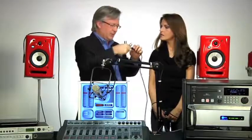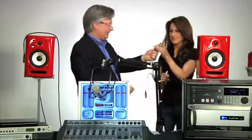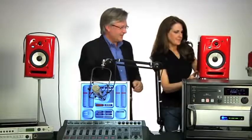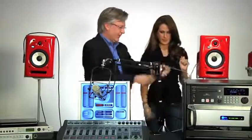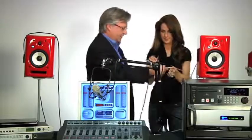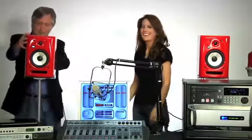Our speakers don't have an RJ connector like this, so we have another adapter from Radio Systems. We'll plug that right in — this is the right-hand speaker, so red right, there we go. Plug that into the back of the speaker. And now the left channel coming out is on this side. Let's just run a cable from this adapter over here to this speaker. How convenient — we'll plug that in, and now we have our speakers connected to the system. We just have to configure it.